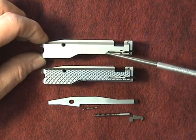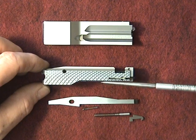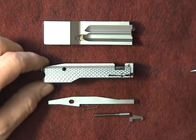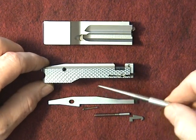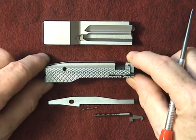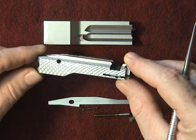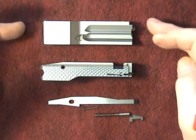You can see the cosmetic finishes. It comes in a mat and also in a scallop finish. The scallops are our rendition of jeweling. We used to jewel them, which is just a polished surface on the bolt, but after a couple thousand rounds we'd find that in cycling it would wear and start coming off and not looking so good. So we came out with the scallops, which are about ten thousandths deep, and they never wear out. I don't know if you see it in the video, but they're pretty cool — they have a 3D effect, it's pretty racy looking. It looks really good and it'll never wear off.